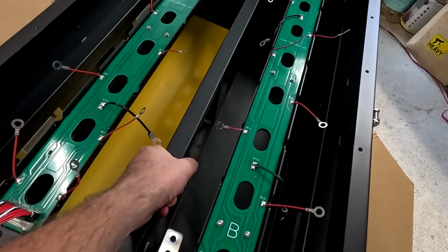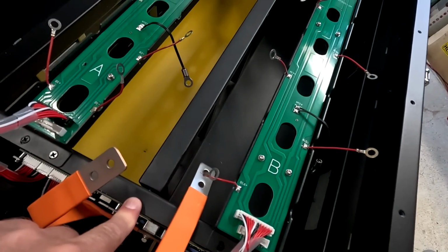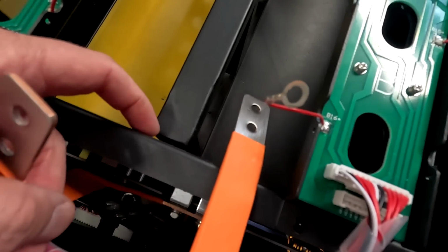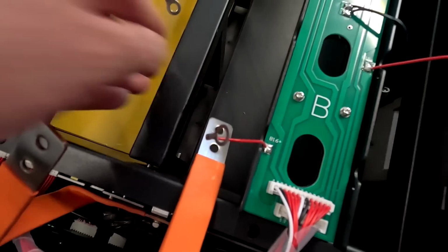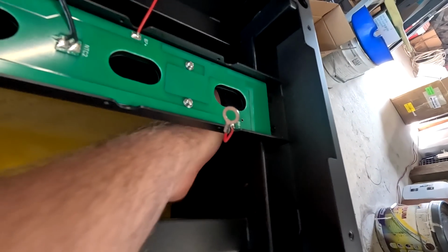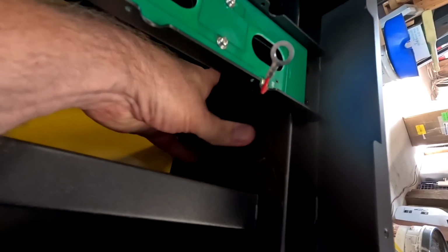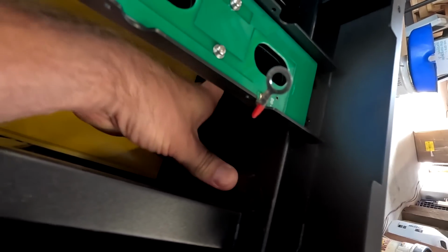And we also have a middle support in between the two battery rows. And this will help us greatly with this compression plate. There you can see the bolt already going from the compression plate into this frame. This is very much what I like to see in all these boxes. And also here at the end, there's no open frame. It is a solid, straight plate where the cell sits against. That's good.